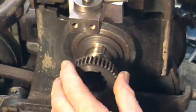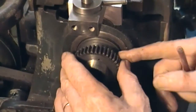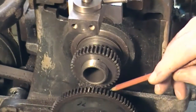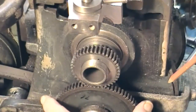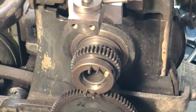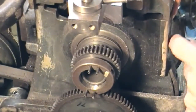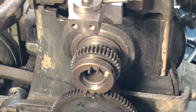Put this back on over the top of it so that will actually sit — you can't see the gap from there. I've got an eighth of an inch gap there by eye and I'm still clear by a sixteenth of the engagement cog. All right, and then this will go back on — obviously not quite as far, but I think this might work. So if we have a five inch disc, I will make some sort of mounting from the headstock casing to take the caliper and we'll see where we go from there.